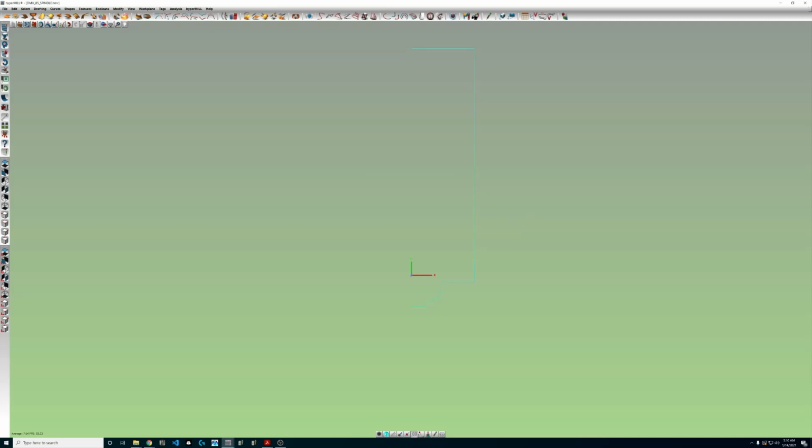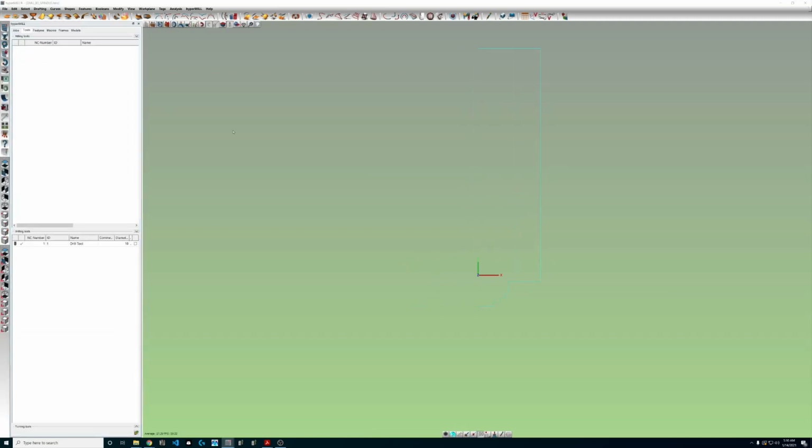Okay, and now the easiest way to do it, I'm sorry I got some of this stuff on another screen here, is here in HyperCAD S. You can do it in the tool database if you want to use the point line function where you just enter numbers in there, the spindle goes over 10 millimeters and then up 5. It's super time consuming and a little confusing because despite the fact you're building out a partial profile, it wants the full diameter value. So the first time I modeled this up, I actually did use that feature because I was oblivious to the fact that I could grab some simple geometry.